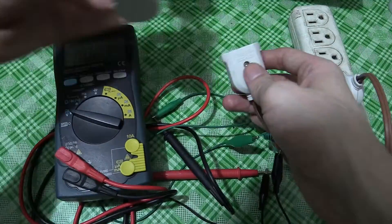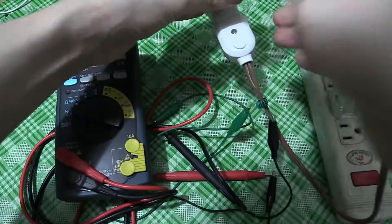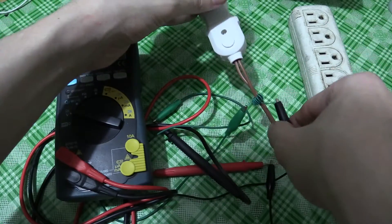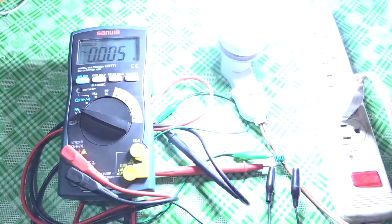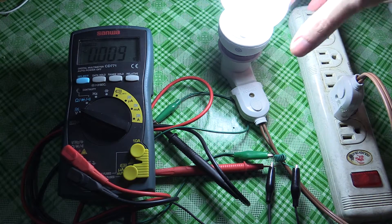In this case, I'm going to plug in a CFL light. We've got the toroid here, I've got my multimeter attached to it, and I'm measuring the voltage. When I turn the light on, you'll see it increases — and this is dependent on the load.